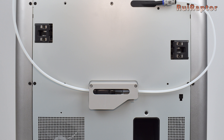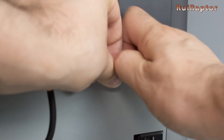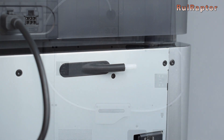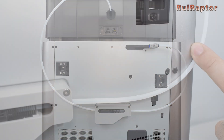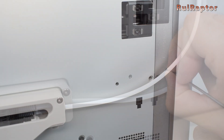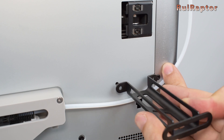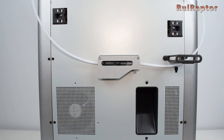If you want to use a filament spool on the spool holder, you need to remove the filament buffer and feed the filament straight through the entry tube. We will install it anyway so it will be ready to use if needed — it will also help to keep the printer away from the wall. You first need to remove the outer screw and then install the spool holder; for the second screw you can get one from the spares.